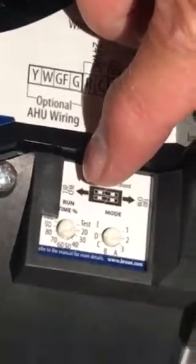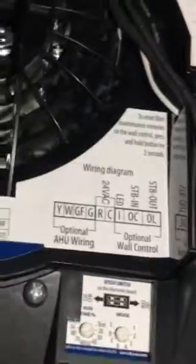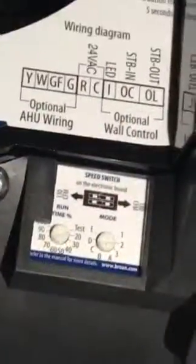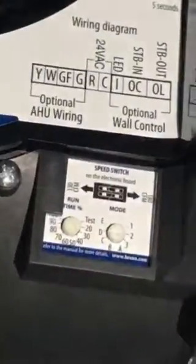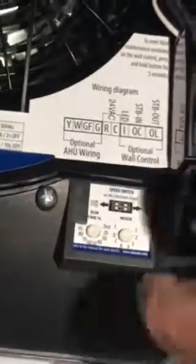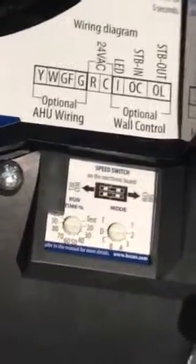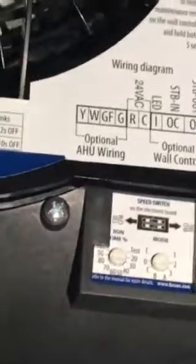And then, as we said, we need 104 CFM. This is set at 120, so we're going to need to run it approximately, I'm going to guess it's about 90% of the time. So if you had a little screwdriver, this would be easier, but we don't have one, so I'm just using my thumbnail. And if you wanted to, you could divide 104 by 120, and it's going to be pretty close to 90%. But do the math and set this correctly. All right, so that's the settings.